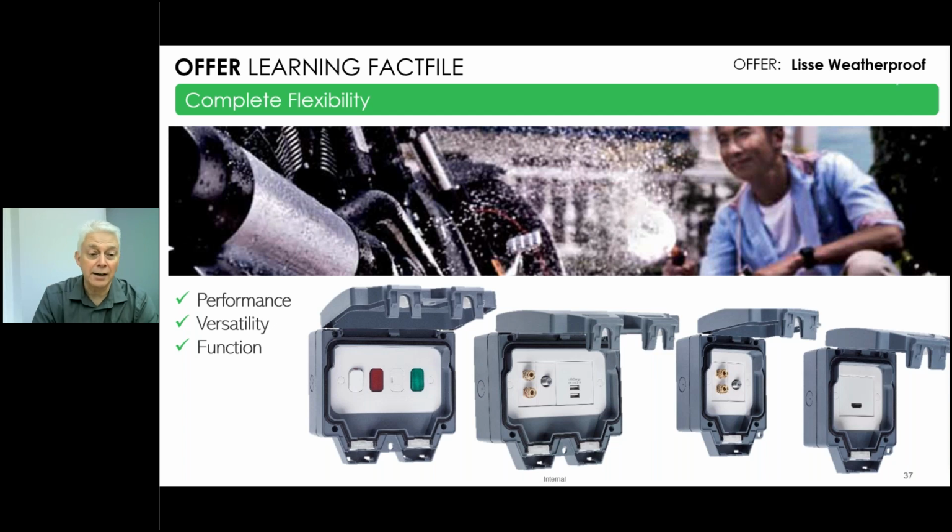The other feature that I didn't indicate but demonstrate is that all of the socket outlet units and the versions with the hinge lids have got these little holes in. You can drop a simple hasp padlock just to lock that device in place. The locking mechanism itself, with the thumb tabs on the top of the product, they provide a very simple but secure and very positive lock that they click into place when the cover's locked, really giving a real reassurance that the product has been locked and shut, and you've got that maximum IP protection.